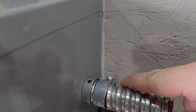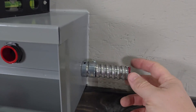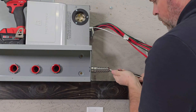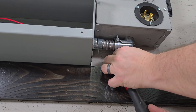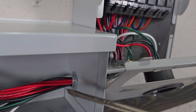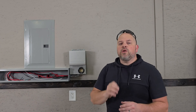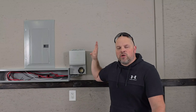Make sure to come back and tighten down the nut on the inside of your transfer switch because this could loosen up and you want all these to be tight. Up to this point, we haven't had to turn off any power, but we're about to run these wires into the service panel, so make sure you're turning off all power. This is a sub panel, so I'm able to use the feeder breaker in my main service panel to turn this off and have absolutely no power in it.